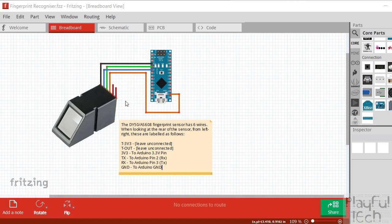Looking at the sensor from the back, from left to right: you can leave the first two unconnected. Then you have a 3.3V supply going to the 3.3 volt pin on the Arduino. Then you've got the transmit pin of the sensor, which goes to the receive pin of the Arduino — I've got that on pin 2. Then the receive pin of the sensor goes to the transmit pin of the Arduino, which I've set as pin 3. You can use other pins, but if you want to use exactly the code as I've written, leave them like that. And finally you've got ground on the end, and that's it.